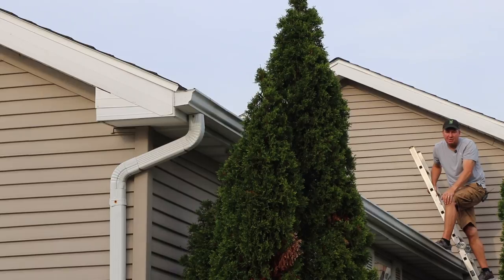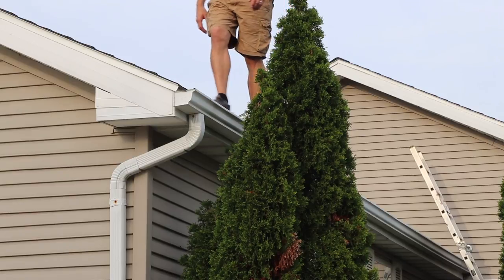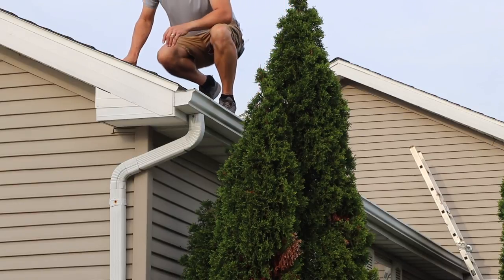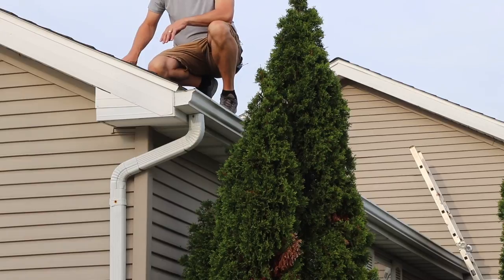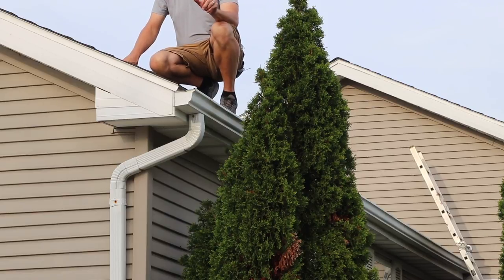So I had a re-roof done on this house almost a year ago, so right now the gutters are looking pretty good. On a roof like this you want to make sure you have really good traction. I walk a lot slower when I get on a 6/12 pitch. A 4/12 is the same thing. Anything less than a 4/12 like a 3/12 I feel pretty comfortable walking. The biggest thing I can say: if you go on a roof, never walk backwards.